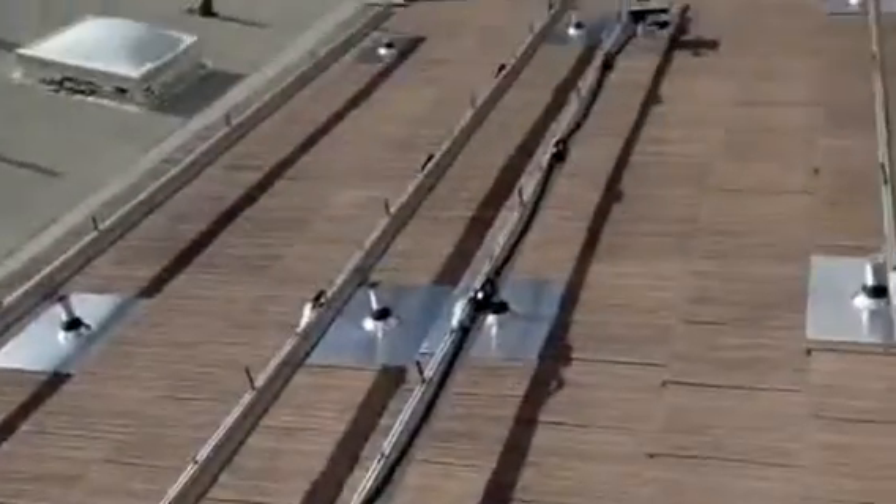A little update: what I've done here is bent a piece of conduit to go from the switch on the roof, across the side of the atrium, and into the garage. Inside the garage, there's a junction box where we'll switch to Romex. That was probably the most challenging part of the project so far — learning how to bend the conduit into that convoluted shape going from the box down to the rain-tight coupler. Now that that's out of the way, I'll be mounting some Enphase inverters and panels.